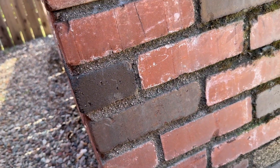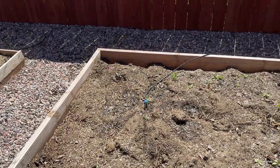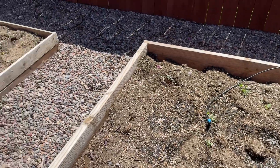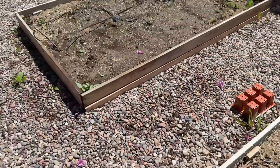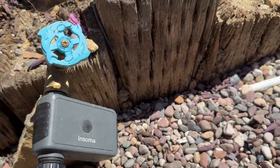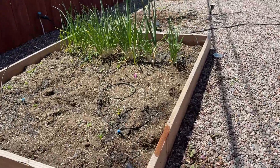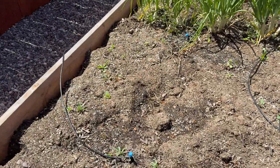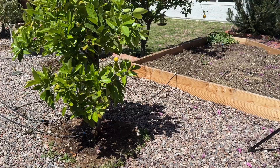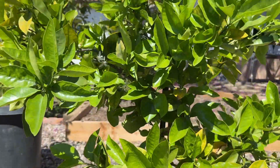I'll turn this off and come back over here. We can clearly see where the pressure is — where those little water marks are coming out on the soil, showing these are also pretty low. After about 10 minutes of automation — or just clicking the button — when that one spigot turns off, you can see these are now more powerful. The water pressure is higher, it can reach more, irrigate more, and sustain a lot more. This sprinkler that was barely a trickle is now successfully irrigating this beautiful pomelo tree.